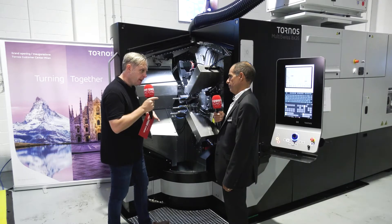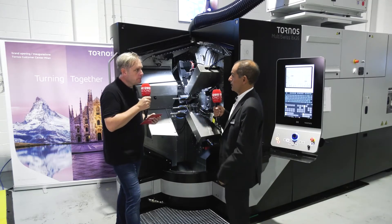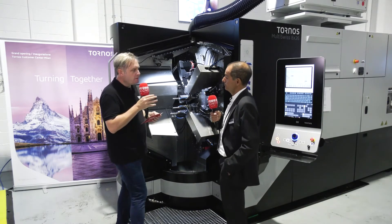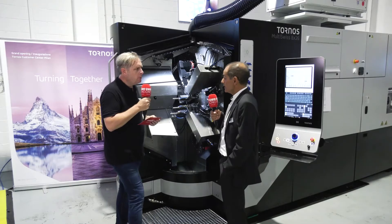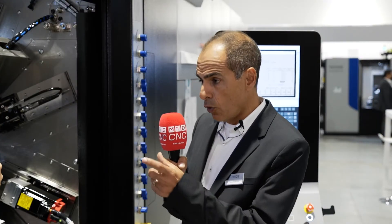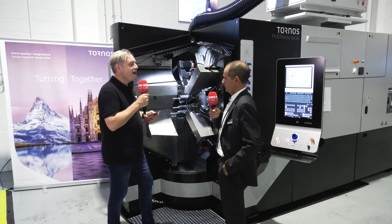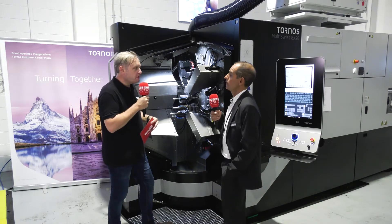What sort of size parts will this make? Normally with the multi-spindle we do parts with a ratio of diameter to length of four times. But now we are proud to present a new version with the tailstock where we can double this size — up to eight times diameter. We're presenting today a long bone screw, and we have two thread whirling attachments inside to produce this bone screw, making even more complex parts and faster.